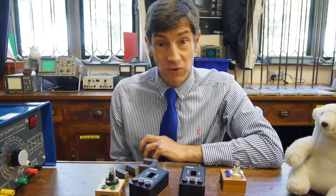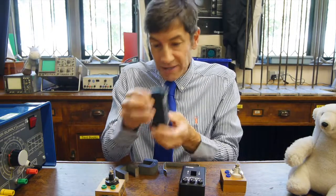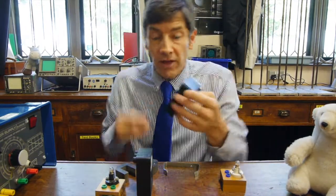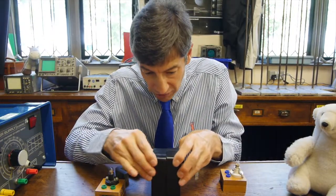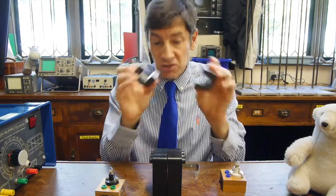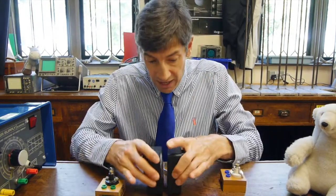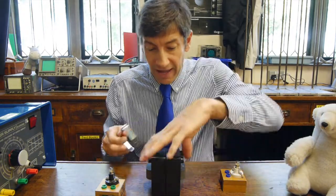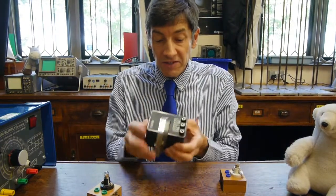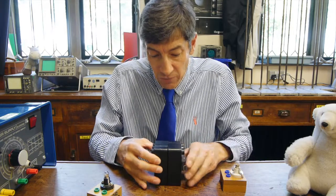Building a transformer is not that difficult. What you need is two coils of wire, each with lots and lots of turns on it. Inside these black boxes is a reel of cable. I'm going to put one on this side and take another identical one and put them close to each other. They're not electrically connected at all. To get them closer and help them work, I'm going to put some laminated soft iron inside those turns of wire. They're still not electrically connected, but soft iron has a strong ability to produce magnetic fields within it. I'll clamp it all together. This is a transformer — the primary is separated from the secondary by an air gap; the only connection between the two is magnetic.